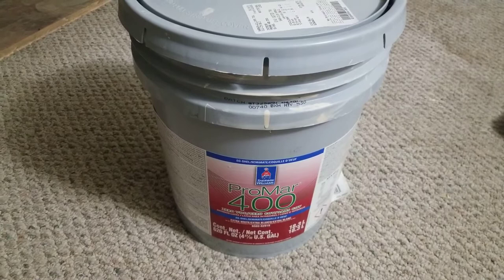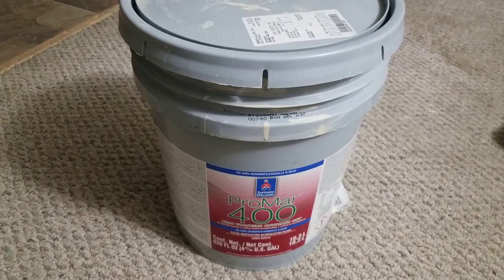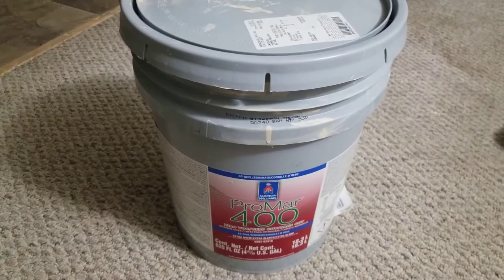As far as how quickly the oil separates in the paint before you have to mix it, I could go about eight hours before I notice it pooling at the top of the paint. This is good enough if you plan on doing it all within one small window, but if you're spreading this out over weeks, you'll definitely need to mix it before you use it each day.